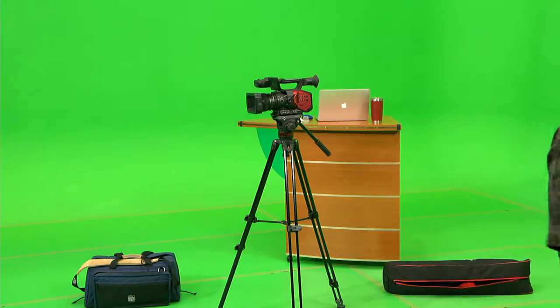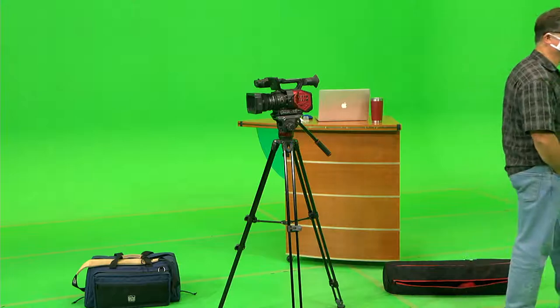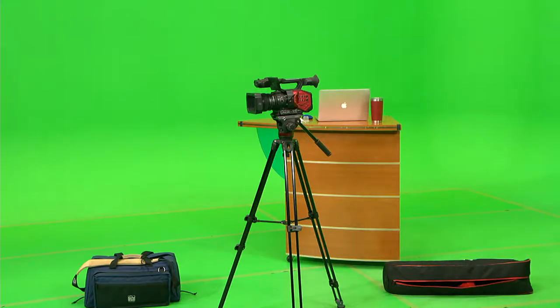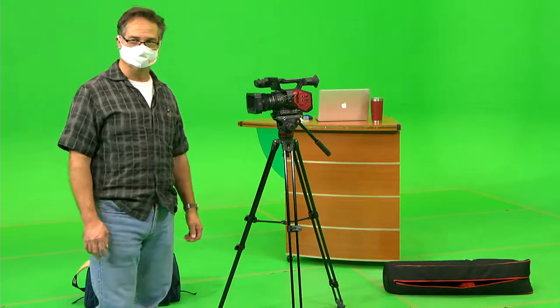Does anybody know the difference between line and mic? But remember the difference. I said it will come back when I was talking about it. And this is that time. The strength of the signal, right? Yes. A line is a 1 volt signal. A mic level is a 1/10,000th volt signal.